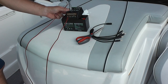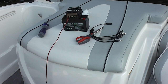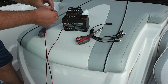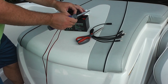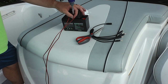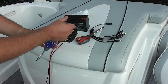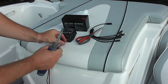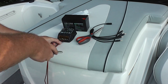What we're going to do now is attach this wire — the other end of this wire is going to go to the battery. I'll go ahead and disconnect that solar panel. Not that it would cause any problems, but I just don't want any juice running into it while I'm doing this. Again, black is negative. I'm connecting this as the battery cable, so it's going to the middle part. The cool thing about this device — you can check the video's description and read the specifics — but I think it has some sort of overcharge protection, which is good if you left your solar panel connected for an extended period of time. And the visual acknowledgement that it's charging is a plus as well.